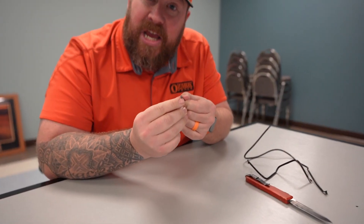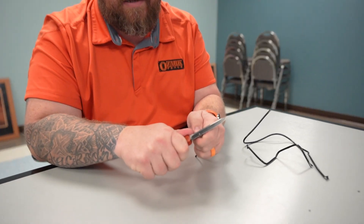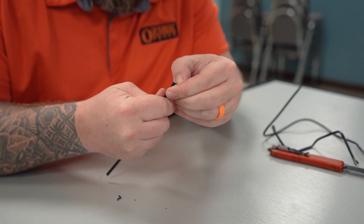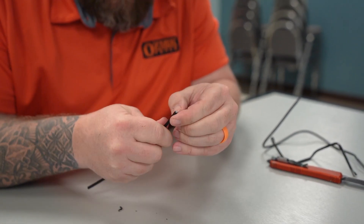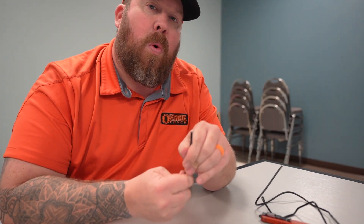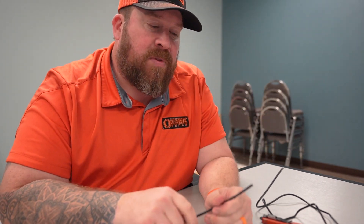Now, let's move on to a separate beast entirely — the fuse-bonded. With the naked eye, we can obviously tell it is fuse-bonded because it has a nine-gauge core and an eight-gauge finish — it's got a really, really small coating. A thicker coating isn't necessarily going to perform better just because the coating is so tough and durable. We'll perform the same test: with fuse-bonded, we can peel off small, small slivers, but the jacket itself is not coming off. The title says it all — it is fused. The jacket is fused to the core, so you get stronger wire with the nine-gauge core and the durability of the jacket actually being fused to it.